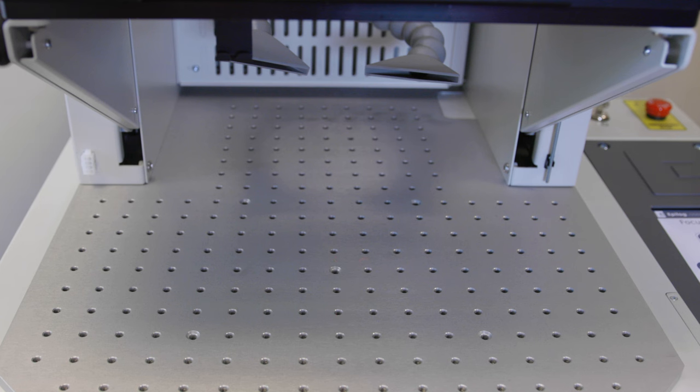Moving on, we'll show the relocatable home position feature. With the red dot pointer on and the joystick enabled, we're able to move that red dot to a particular location. That can now act as our zero position — making that location the center, left, top, or bottom of our engraving. It's a really handy feature for those odd-shaped parts where you need to use the relocatable home to find your new home position. The trace feature gives you a bounding box that goes around the image that we're going to be engraving.